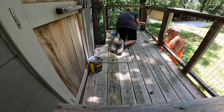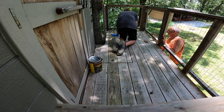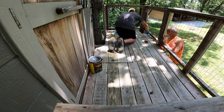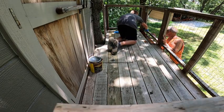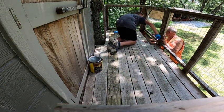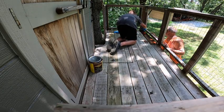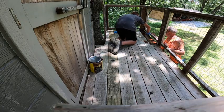All right. You know how to wet it? You go in. Now run it up and down on there a bunch. All right, now see how it paints. All right, you always start away from the end and work to the end. Otherwise, you're gonna leave a big wad of paint at the end. You can't get there. All right. When you get down here, then you're gonna run a roller stroke all the way from that end all the way down to here, blending it. Full length roller stroke with no paint on it.